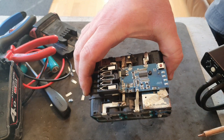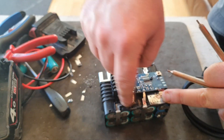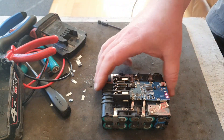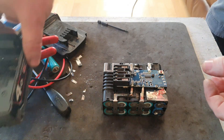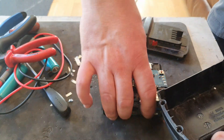That's all the spot welding completed. You can see the positive and negative and all the cell balancers — they're all connected. And we're showing two bars, so that bodes well for the fix. All we've got to do now is throw it into the box and see if the fix actually worked.